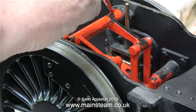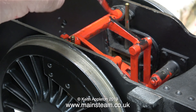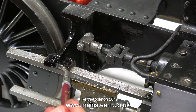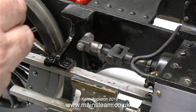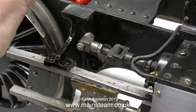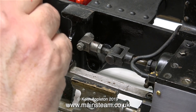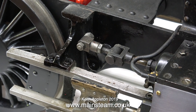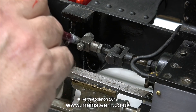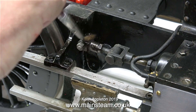If you look at this system carefully you can see how it works. The shaft I'm painting at the moment can be rotated from a lever from the cab of the engine, and as this shaft is rotated it lifts the expansion links up and down. I don't like to use too much red paint, so I'm using some black paint — this is HMG Satin Black. I've sprayed some of it from the aerosol into the plastic cap and I'm using a paintbrush to apply the paint, as it would be highly inconvenient to mask off all the bright parts just to spray these smaller bits. The part I'm painting at the moment is the motion bracket, but I'm also going to paint the valve operating linkage, because this is really underneath the running board and very difficult to get to, and it will only go rusty if I don't do this. As far as I can see, most of it was painted black in the first place.